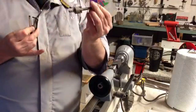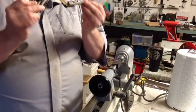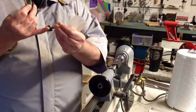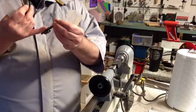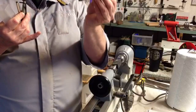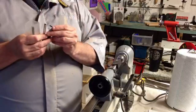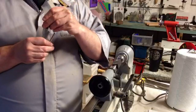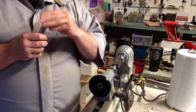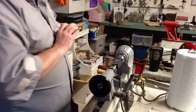So that bar fits inside, depending on what it comes supplied with. This is a barrel trimmer kit, which comes supplied with different diameter rods to suit the different diameter pen tubes, and then it has this, almost like a four prong drive spur, so you can attach that to your drill or your pillar drill, and square it off that way. It's quick and easy. I started using my belt sander for it, and I just prefer that method. But these are very quick and effective barrel trimmers.